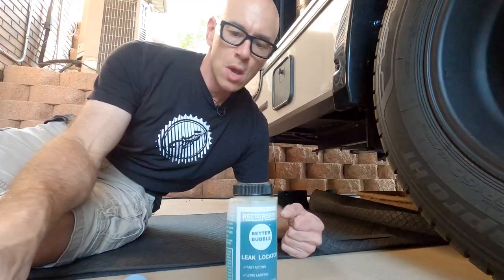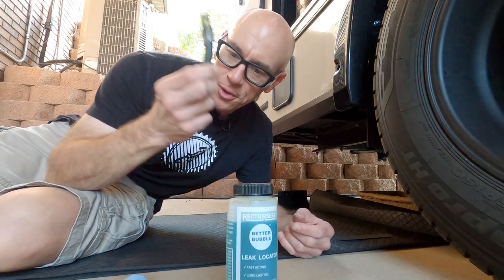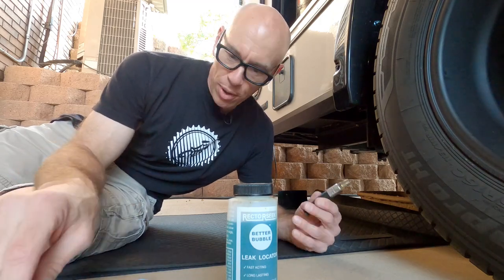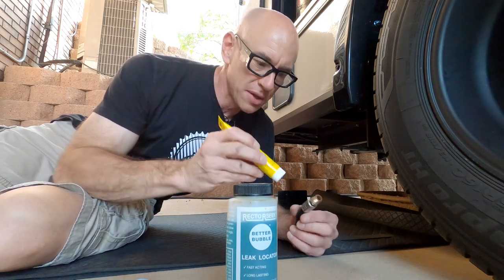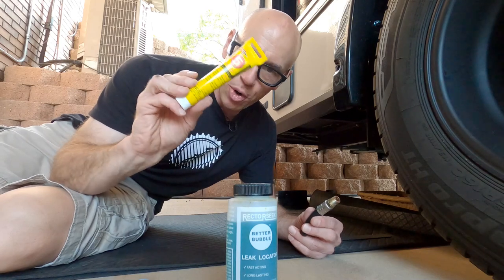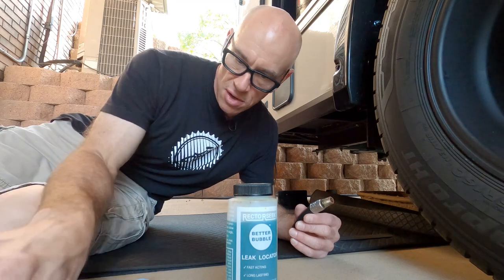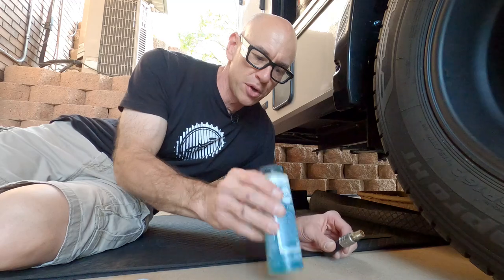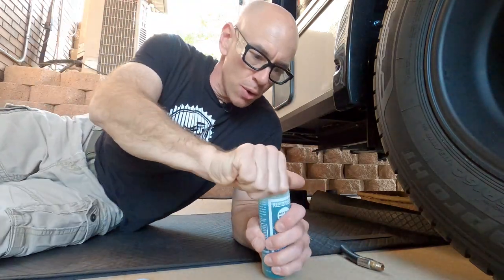All right. Okay, so this was the propane thread fitting that goes into the manifold. Took it to the store, got another part. So important keys for success: get the right part, which I did. Apply a thread sealant, because this is just a threaded fitting, not a flare or anything. Apply an appropriate thread sealant for whatever your fitting is, in this case propane, and this is fine for gas and for brass. And then, probably most importantly, when you're done, check for leaks, and that's what I'm about to do. And here we go under.